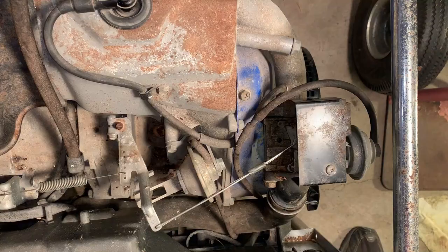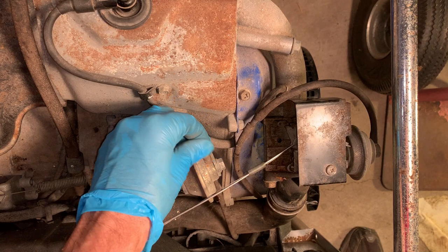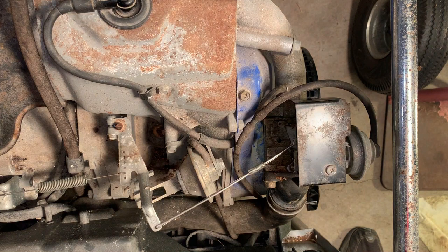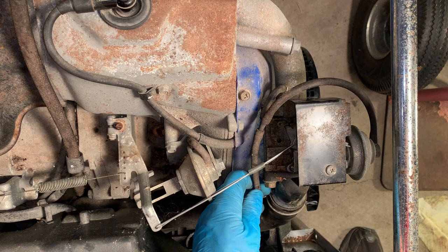So there's a number of things going on here. There is a servo vacuum operated right here. And this here is the idle down feature. It acts against the governor to slow the engine. Also, there's another servo right here that is an auto choke, and that's connected to the manifold so that when the engine powers up, it actuates the choke, basically opening it up.